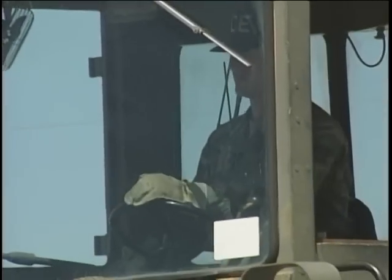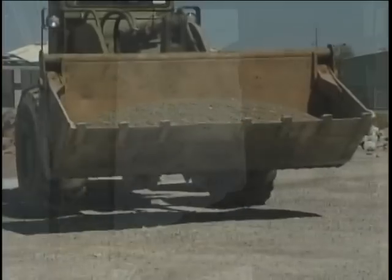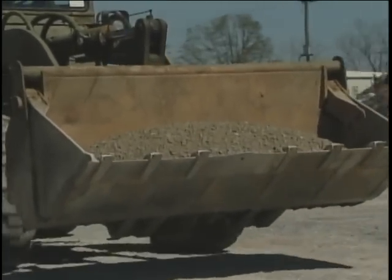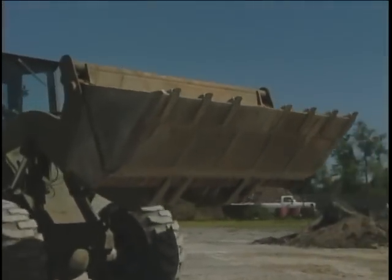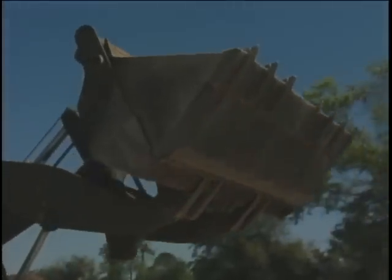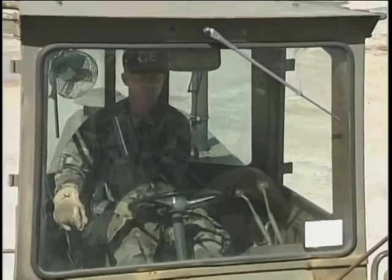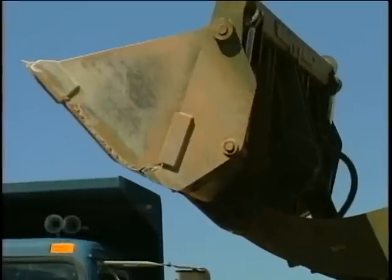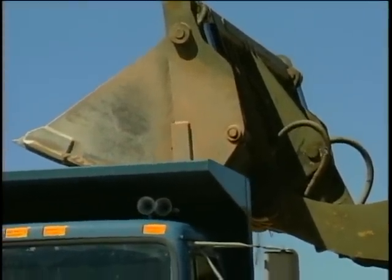This time, instead of just tilting the bucket over, we will open the clamshell. Approach the dump truck with the bucket slowly rising in the air. When the bucket is above the bed height, pull the loader forward until the bucket is centered over the middle of the bed. Once again, watch the front part of the bucket to ensure it clears the headache rack.